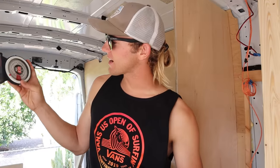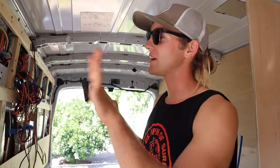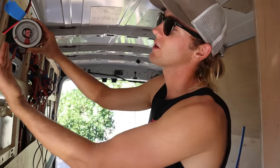This tool is kind of like an angle finder. When you're using this, you've got to make sure the van is pretty level so that when you put it up against something, whatever is at zero or 90 degrees is actually zero or 90 degrees. A few minutes ago I put a piece of wood up here and laid this angle finder up against it, and as you can see, it's got a five degree angle up this way. That is super helpful for when you're cutting all of your pieces of wood — you already have a consistent angle to follow along this back wall.